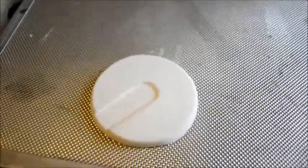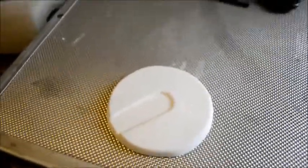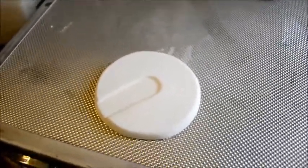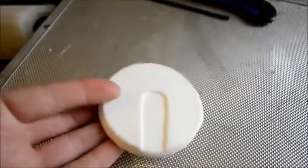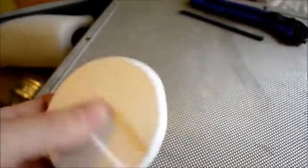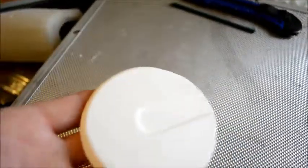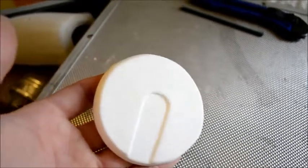Hi everyone, it's Gary at Starks Warehouse. I'm just getting on to the moulding process of moulding all the pieces at the minute. This is a solid resin ear that I just made — I made a quick silicone mould up of the foam ear, pulled the resin piece from it, and gave it a quick sand down to smooth everything out.